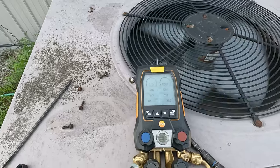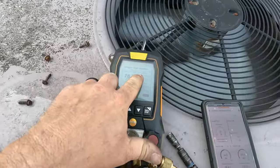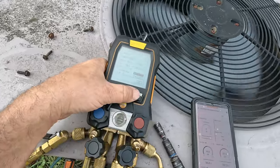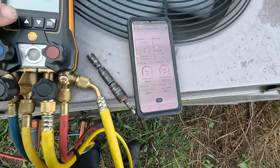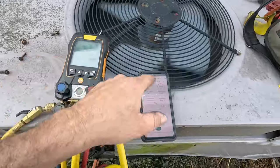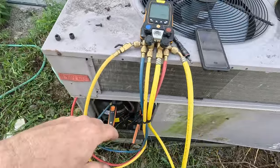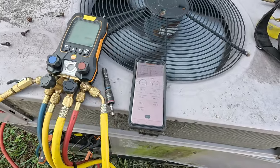Let's go ahead and get this blown into a container and see where we're at. Outdoor dry bulb temperature is 76.6 — I've got 75, so we're within a degree, degree and a half. Return bulb temperature is 62 wet bulb. Calculated superheat is now 15 degrees. We can see our pressures over here — this is kind of a clone of the gauge. You can see subcooling and superheat on the app here, but it clones it. Target is 15, we're at 13 — so we're right in there. This is very sensitive — I took just a little bit out, had to add just a touch back in. Probably not even six to eight ounces. It's very minuscule — easy for whoever to overcharge it.